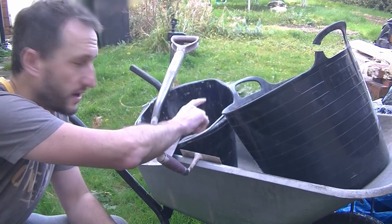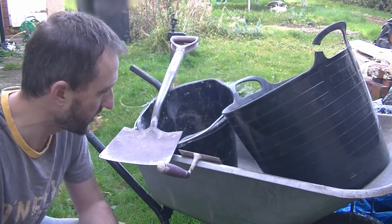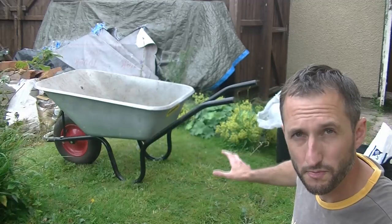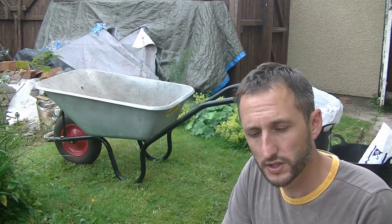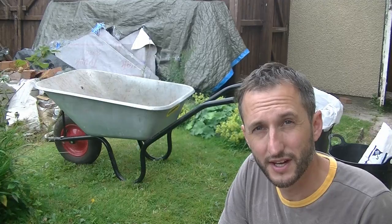The tools you're going to need for this job are a bucket for measuring your materials, a tub for carrying the mixed render, a bucket trowel, a spade for mixing your render, and a wheelbarrow. I'm going to use a bucket to measure out my units. By using one bucketful or half bucketful, I can get my ratios. We're just doing a scratch coat here, so the mix is one Portland cement to four building sand to half hydrated lime.